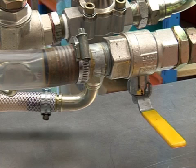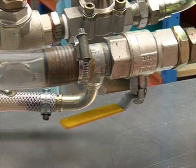If a block valve is used, ensure that its diameter is that of the pipe itself and that it is fully open when the pump is running.